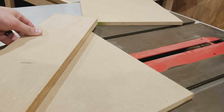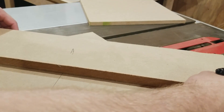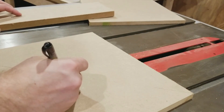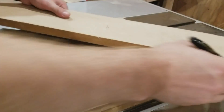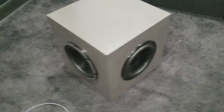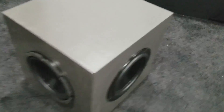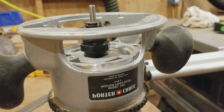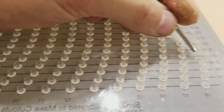With the wood in the shop, we want to find the center of the pieces we're cutting the woofers out of. To do this, find a straight edge — I used a leftover piece of MDF — and line it up to each corner to draw a straight line. Where they intersect is the center. I put the subwoofer and passive radiators on three sides each, and the plate amp on the other sides, so air gets excited in every direction and it looks really awesome.